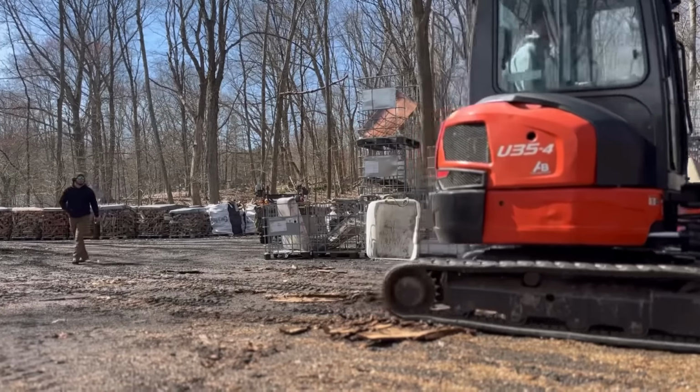Yeah, and the reason you want to work 10 to 2 from where you're picking up is that if you go all the way over here, you're only going to be picking up this side of the machine. You need to be picking up the front side, or the blade side, of your machine. That way you're getting both tracks up off the ground, and then you're really just spinning on the back part of your tracks, which is very little ground contact.